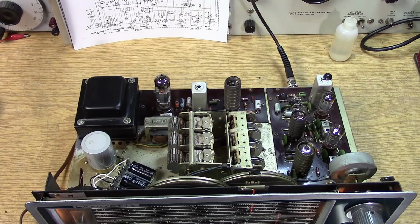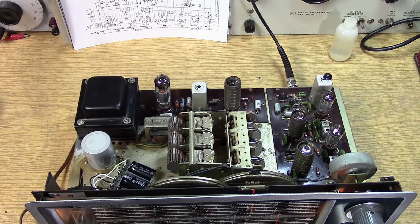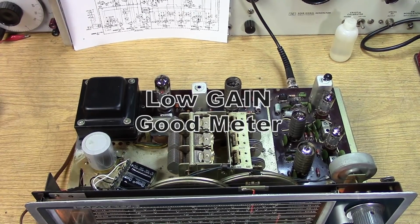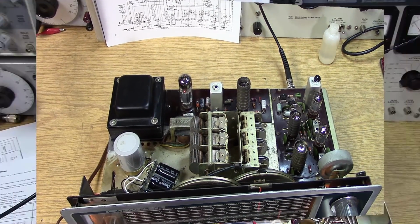So the first thing that we notice with the receiver is we have almost no hum at all. So big improvement by using the 3 capacitors instead of the original. I've completely disconnected the original. No more hum. Now, the receiver doesn't seem super sensitive. It's picking up all kinds of stations, but it's not fully tuned, that's for sure.